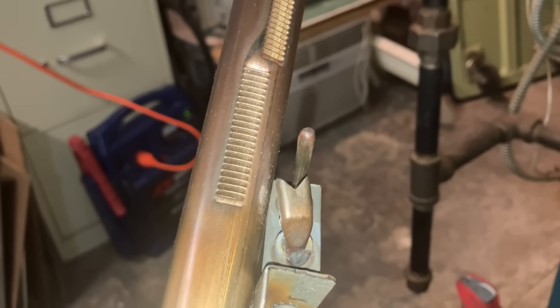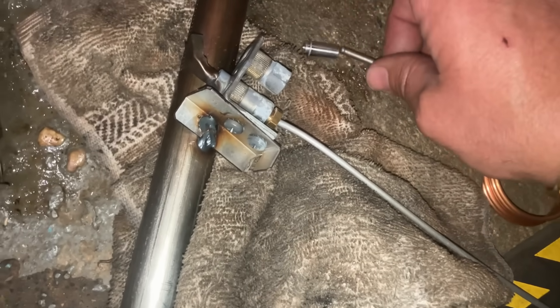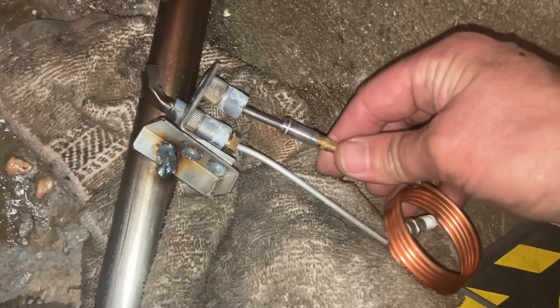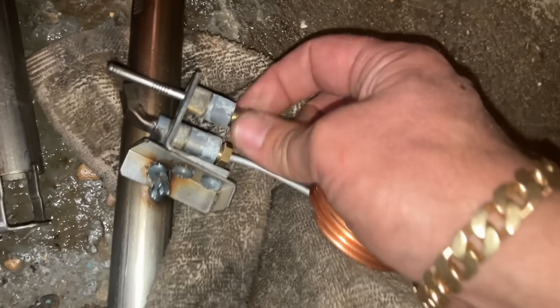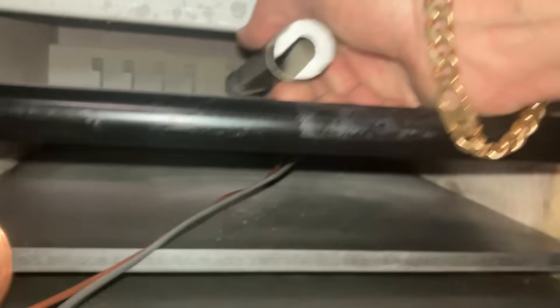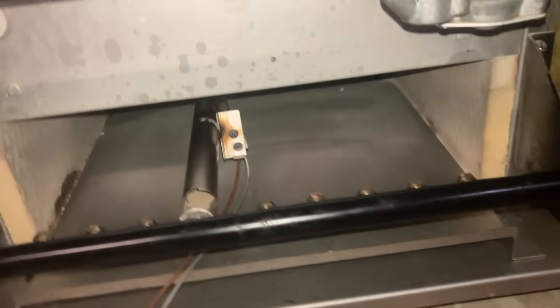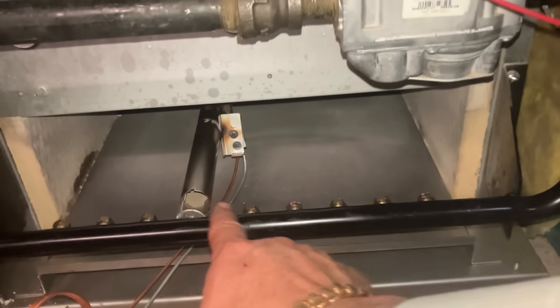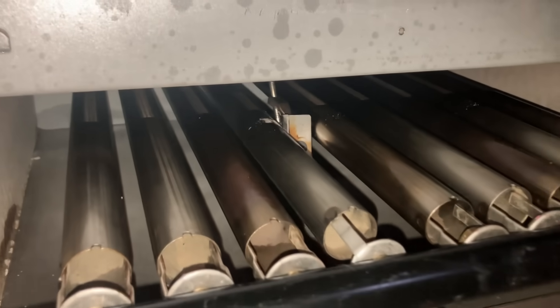You don't want to be there — absolutely not. All right, so let's change that out. It unthreads right from the bottom. Let's not lose that little piece. Get it in right there. I'll go in there and then thread in that nut holding it in — perfect. Now the fun part. That goes in there just like that, but we are in the wrong one — four across from the right. Four across from the right — perfect, because it's a little bit wider here and that accommodates the separation on the gas manifold. All right, all the burners are back in.